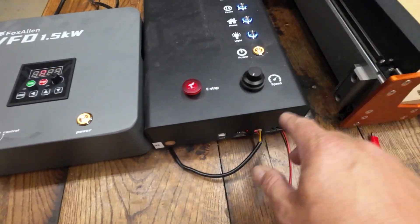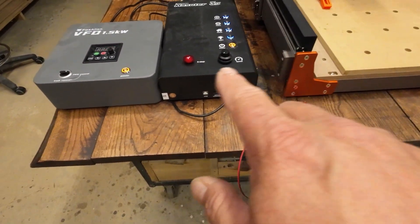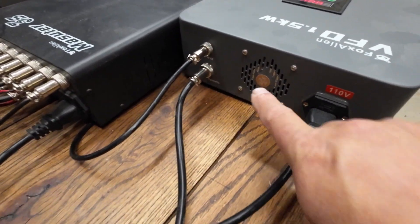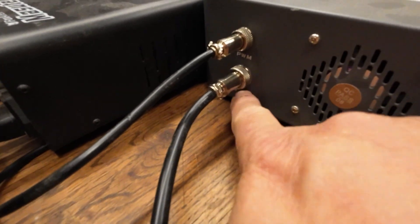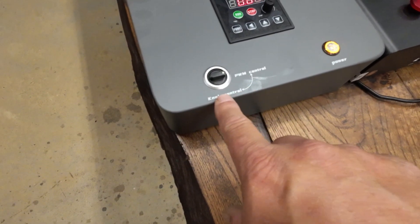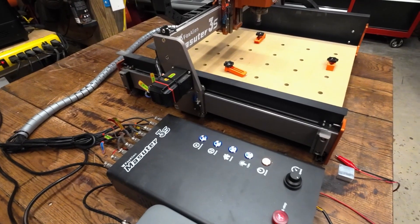As far as the VFD controller — I'm going to turn everything on so you can see what it looks like. Everything illuminates. You will have to plug in this little cable where it says laser and switch the switch over to laser. There are also some settings that need to be changed on the controller of the machine. Read the manual before powering any of this up, because you could damage the setup if you don't configure it properly. The controller is basic: you've got power, the PWM wire that goes to the laser output, and then the output that goes to the spindle by way of the drag chain. Setup was simple. You have PWM control and knob control — options to let the machine control it or use the knob manually.